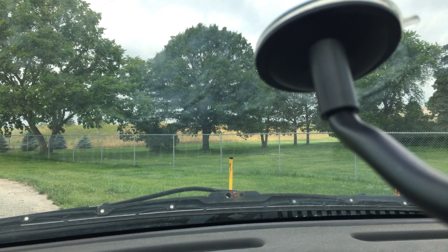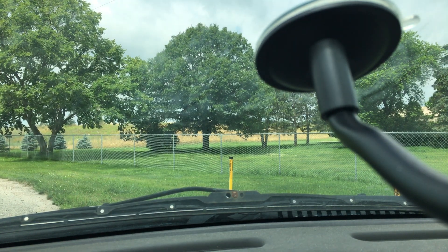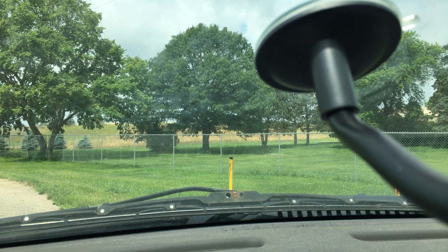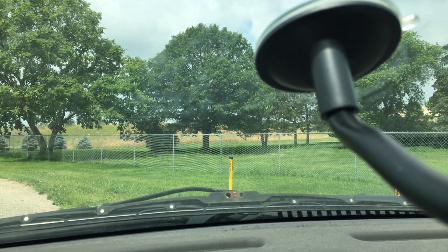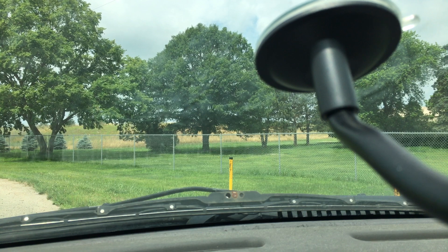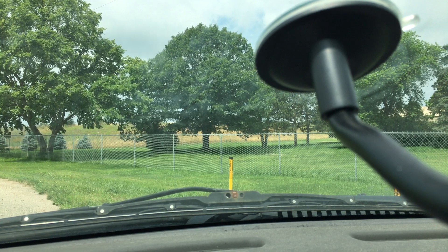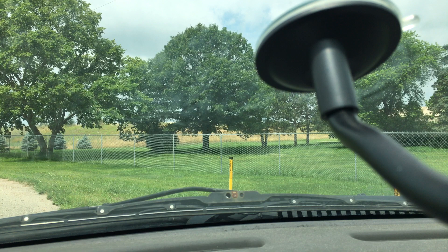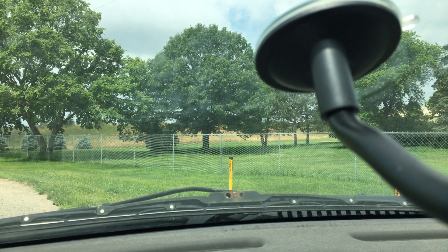Technically speaking, this should go further than the GMRS frequencies. About 20-plus years ago when they were trying to switch the county sheriff to 800 megahertz, it would not work — horrible reception. They ended up going back to the 155-something megahertz frequency, because that travels better through the trees, hills, and bluffs. This first location is 0.8 miles away as the crow flies.